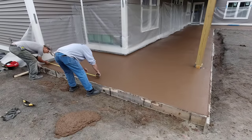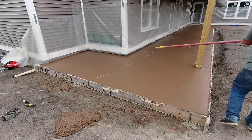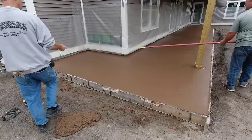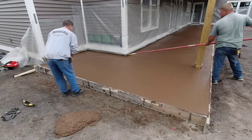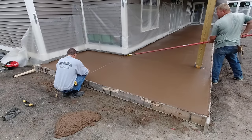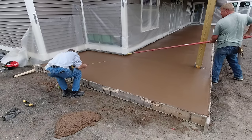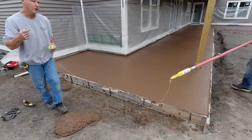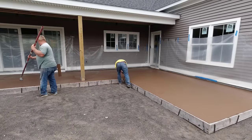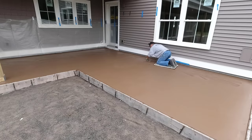I believe it was about six feet six inches to the corner — the same as the corner of the building — and we want to make sure as we stamp down the length of this patio, when we get to that point our stamps are right in line with the chalk line snapped in the concrete. The concrete's too wet to get on right now, so there's no way to really reach out there and get a good line, which is why that method worked pretty well.